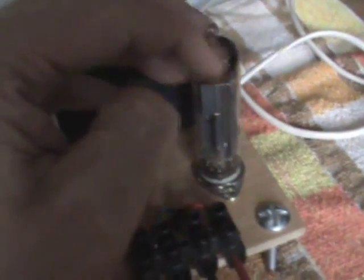I've been doing some studying on the tubes, by the way. This tube is capable — this is an EZ-81 — and I was going to use in the circuit an EZ-80, but the EZ-80 is capable of delivering 90 milliamp of current, and the EZ-81 is capable of delivering 160 milliamp. So I've gone for an EZ-81 here, and my amp will be a single-ended — known as a single-ended.